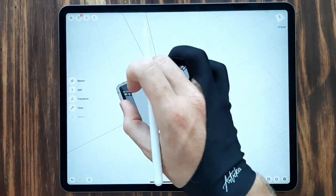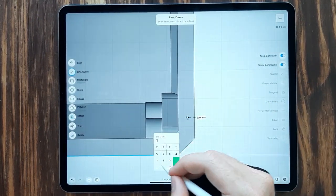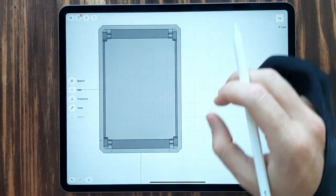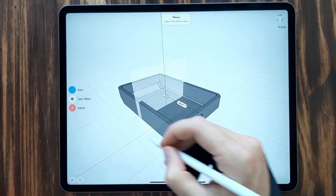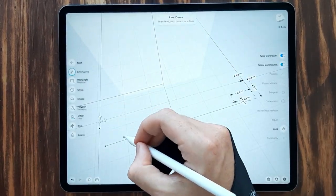Returning to these holes I just created, I am going to draw 2 more holes on the other side and I'm not going to drill down. Instead, I'm going to create a construction plane which I push to the middle of this body so I can use it for mirroring. And this is quite a good method to keep in mind because you'll probably have to use this quite often. It just speeds up progress.